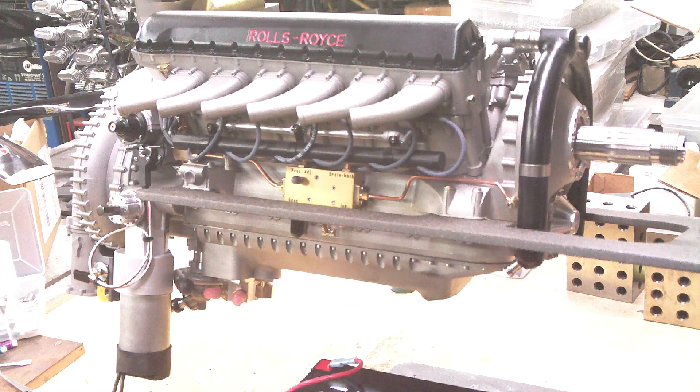The second way to start the engine will hopefully be a full electric start. Finding a suitable motor to do this has been a little more difficult than I first thought. The motor I'm currently using is a 750 size brush motor from a John Deere JS30 lawnmower. There's a 10 to 1 gear reduction between the shaft of this motor and the crankshaft, and even so, it's able to crank the engine at about twice as fast as the manual starter.